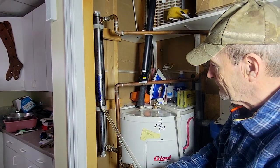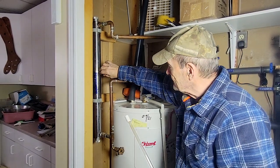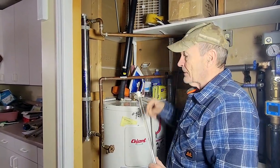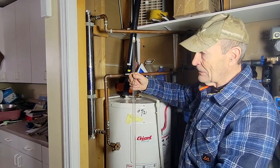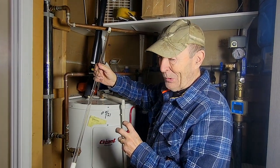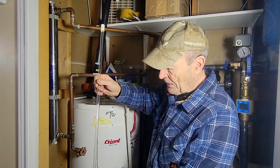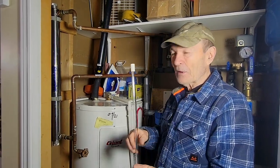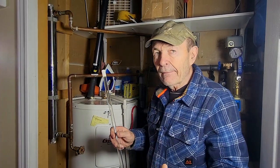It's just a long stainless steel tube. Inside that tube there's a glass quartz tube — so there's an outer jacket and an inner jacket. The water comes from the softener, into the sterilizer, and then into the house system. Inside there's a long bulb, very much like a fluorescent bulb. When it's turned on, it glows with a beautiful ultraviolet purple color — don't look at it for too long. As the water passes through the jacket around the bulb, those ultraviolet rays kill all the bugs, germs, microbes, and viruses. They stay in there but they're dead, so they're not dangerous.